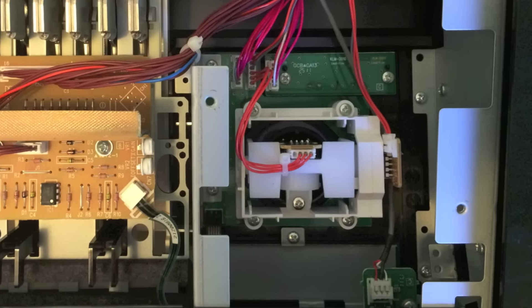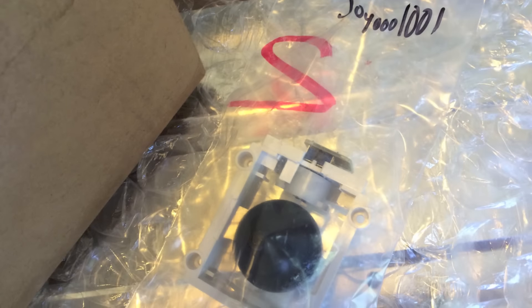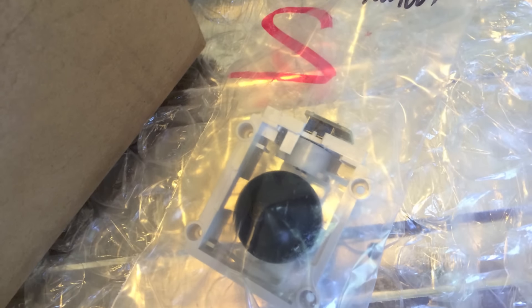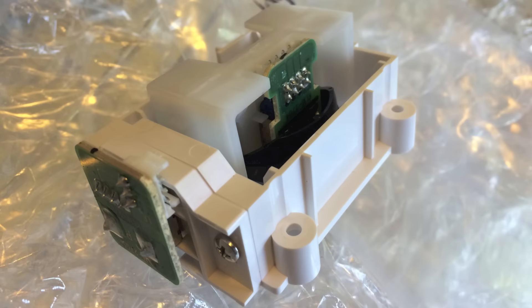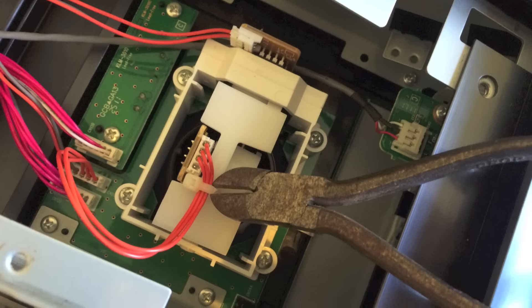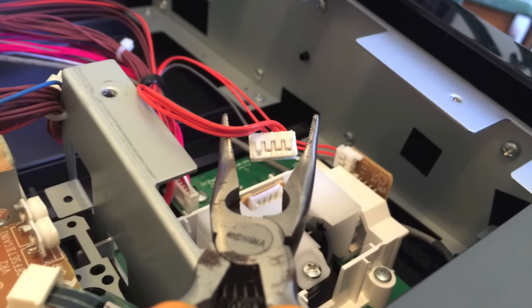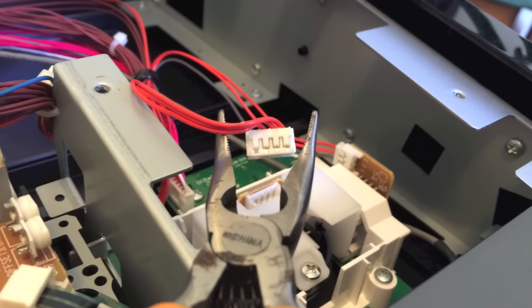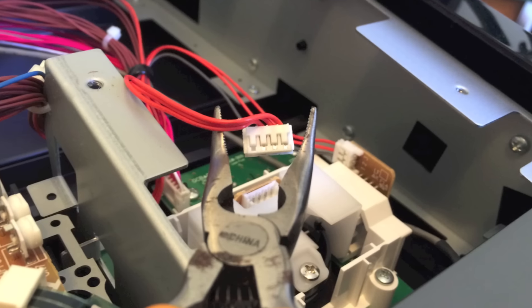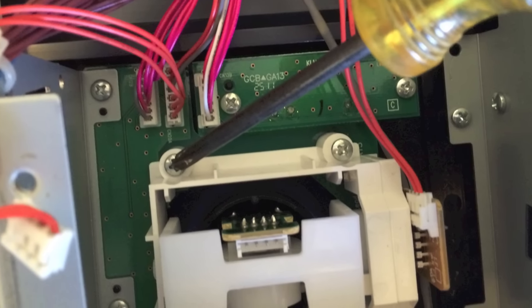Don't remove the wiring harnesses yet — we'll get to that very soon. Here's how the replacement part looks when you receive it: this is the top view looking at the joystick itself, and these are the two contact points where the two wiring harnesses will be attached. Use a snipper to cut the zip tie — don't use a knife because it's too easy to accidentally cut the wires. Use an offset needle-nose pliers to pull out the wiring harness by the plastic harness, not by the wires.